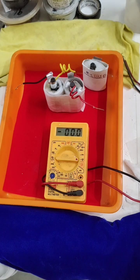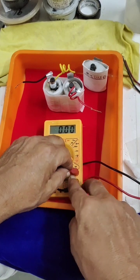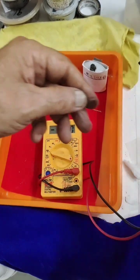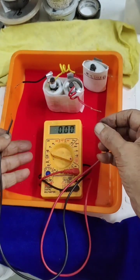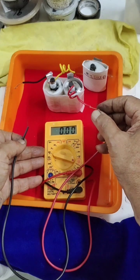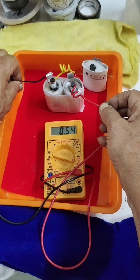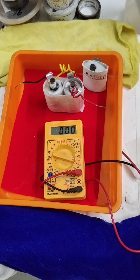I set the meter to 200 milliampere range, then to 10 amps. This is only after charging — after some 10 cycles it will stabilize further. You can see it is giving nearly 500 milliampere. So 3.7 volts and 500 milliampere — if you repeat the cycles it will improve.